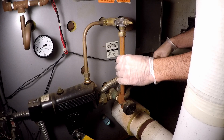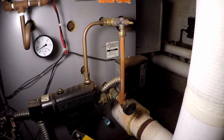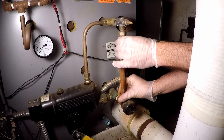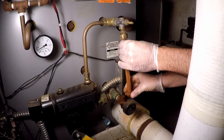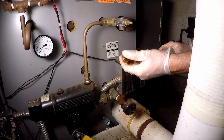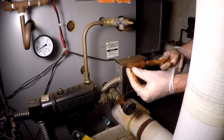Changing out this sight glass is at first a little scary or daunting, but in the end it really didn't turn out to be that big of a deal. What you want to do for sure is close off the water on the bottom, make sure the boiler's off, there's no pressure. There actually is no pressure — that gauge was just stuck a little bit due to sediment. This has been off and cool and sitting for a number of hours before I did any of this.